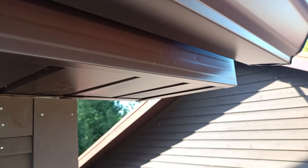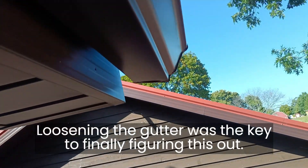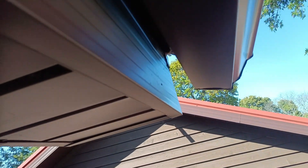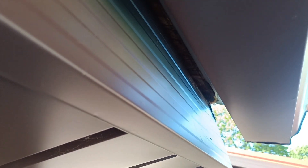I decided to loosen the gutter up and have a look from down below. When you look from down below you see the old roof strip edge — that white strip — and you can see the roof decking. There's a massive gap between the roof decking and the fascia, and you don't see that from up here. When you stick your fingers up underneath here behind the drip edge, it feels solid because there's a second drip edge up underneath there that I was missing. By pulling this loose, based on the customer's observations, I was able to find that second opening — the second drip edge — and then I see the gap.